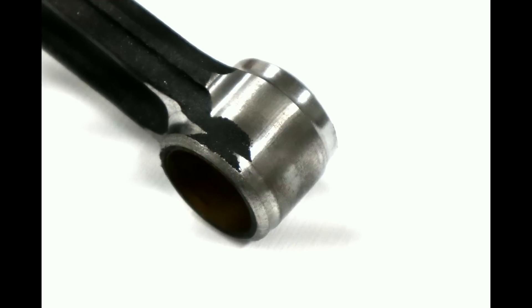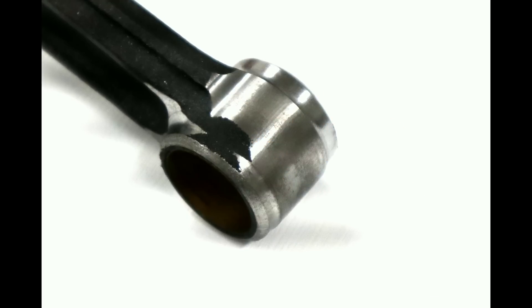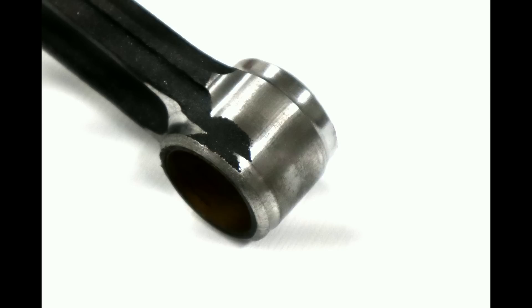This shot should demonstrate what I was talking about earlier. You see how it hasn't cleaned up. This rod here was the one with the worst forging to pin offset. So machining the rest down to that level shouldn't decrease the strength of the rod by any significant degree. Whatever it is reduced by, we will more than make up for it by the reduction in the reciprocating weight.